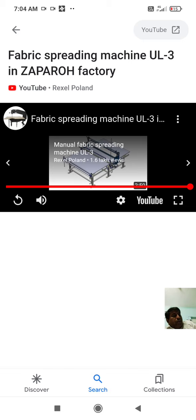Generous marking: the marker is too wide, so garment parts at the edge of the lay are cut with bits missing. Not enough knife clearance freedom. Mismatched checks and stripes. Notches and drill marks omitted, indistinct or misplaced. Each spread should be inspected before commencement of cutting for the possible defects mentioned above.